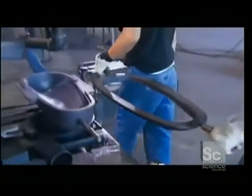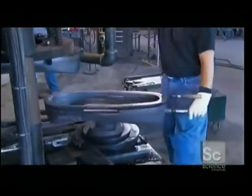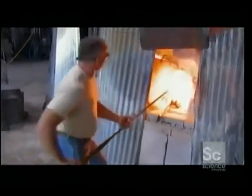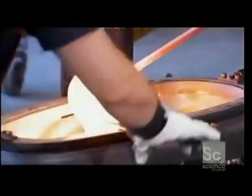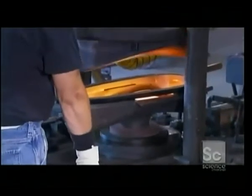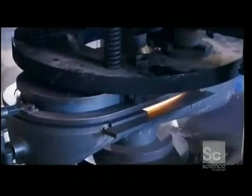Next is on to the molding process. Workers heat a ring and transfer it to the top of a mold. Then they twist and turn a stick called a punty to gather some melted glass and carefully string it in the mold. A plunger squeezes the molten gob into shape. The glass solidifies in seconds.